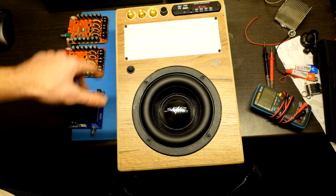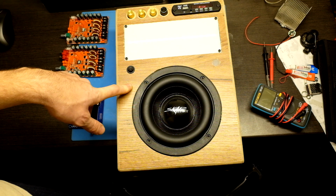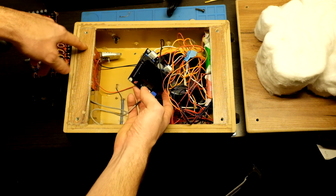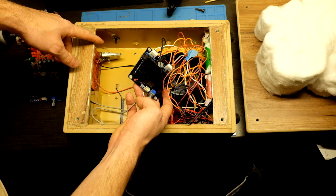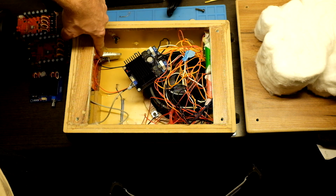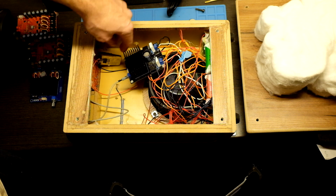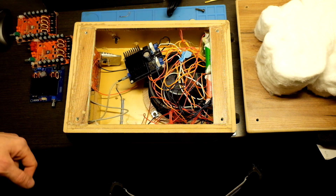So subscribe and you will see. The boombox now weighs 7.3 kg with batteries. One small modification after switching from 24 to 34 volts: I noticed that the linear regulator is overheating and unstable, so I added a heatsink, but I will replace it with a digital PWM unit later.